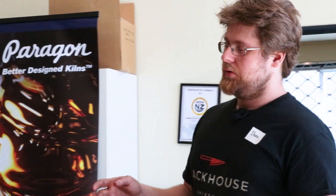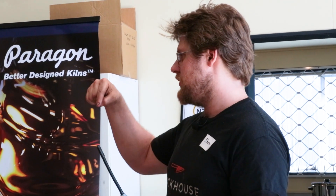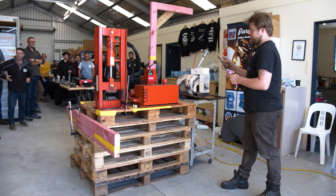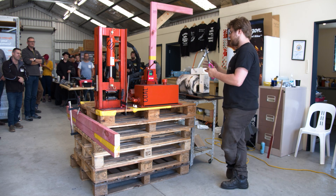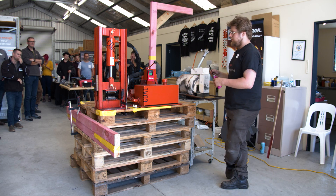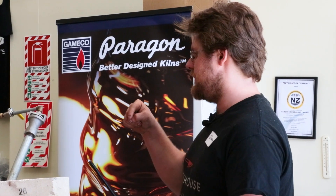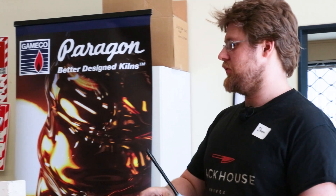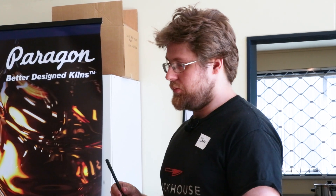The main reason I got this was so that students could punch holes in hammerheads - large sections of 45 millimeter square or 50 millimeter square. I've made a really jerry-rigged cage just to test it out to see how well it works. I've ordered one of their proper ones. If you're on the ball you can pretty much do the hole in one heat, which is really handy, instead of multiple times having to use a drift tool and an anvil and maybe another person to help strike it. It just makes the job really repeatable.